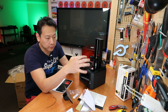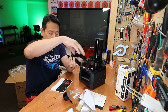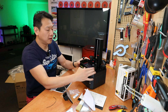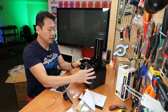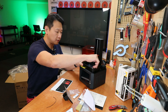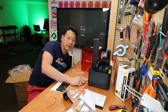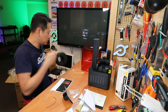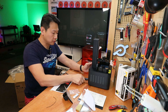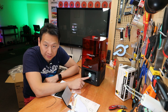You fill about 170ml or 200-something ml depending on how big your model is, as the volume of resin will go down as the model comes up. Make sure the groove line is on the right side, then put it back onto the screen and screw it down. To power up the machine, plug the three-pin lead into the back — it's not very long so you may need an extension. Then turn it on and it boots up with the Creality logo.